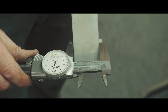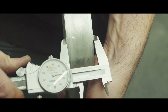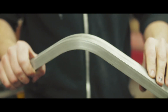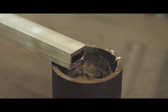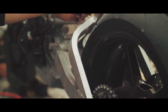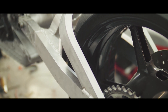Right here we've got our nominal thickness which is inch and a half, and at the inside edge of the bend we've got inch and a half plus about 40 thou, and on the outside you've got inch and a half minus about 40 thou. This is about as good as mandrel bending — there's really not much difference structurally here. Once I completed the bend, this piece gets trimmed to length, lined up in the CNC, and I make this cut at an angle so everything fits perfectly and then just gets welded up. So that's how I make that part.